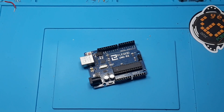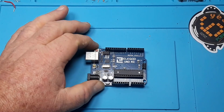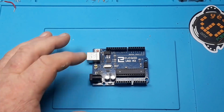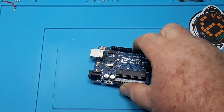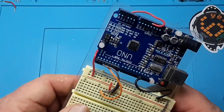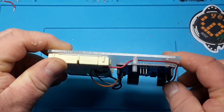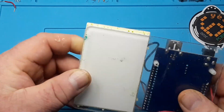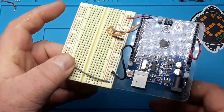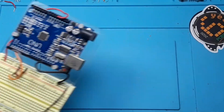Tip number four: get yourself some way to mount your Arduino and a breadboard. If you just do a search for Arduino trays, you'll come up with all sorts of things. The cheapest option is just a plain clear Lexan panel with some holes drilled in it to mount your Arduino. Use some double-sided foam tape, mount a breadboard, and you're good to go.